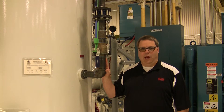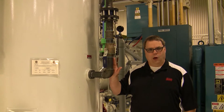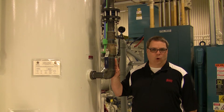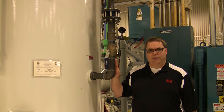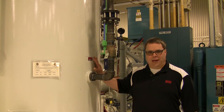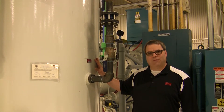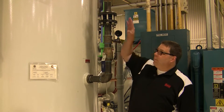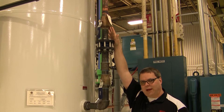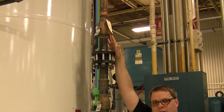This is the gas inlet line that feeds the gas reservoir system. The gas inlet side carries argon or nitrogen in gaseous form from outside the facility. On the outside of the facility there is normally a liquid system and an evaporator. The evaporator converts the liquid to gas, which in turn feeds into the tank. The line feeding the tank and the line exiting the tank to the furnace must be free of leaks. We always recommend having a service valve in the tank which allows us to separate the tank from the outside source in the event that the tank needs to be replaced or serviced.